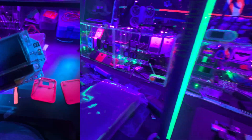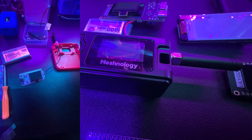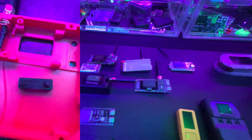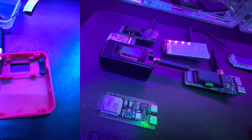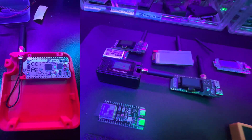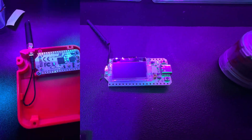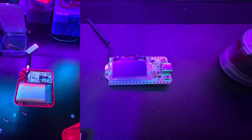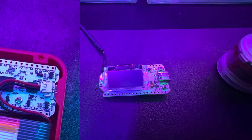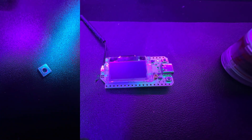This guy comes with a battery, a cool case, and an antenna, but it's basically just a Heltec V3. You don't need to buy the whole case — I'll leave the link in the description. To start out, you can get this on Amazon. I can see prices ranging anywhere from $15 to $30 for this guy. Really easy to set up and put Meshtastic on it. I'm actually going to show you how to do that real quick in this video. To get it in flash mode, you have to hold down the program button and then plug it in. You know you did it right if you see the flashing light.